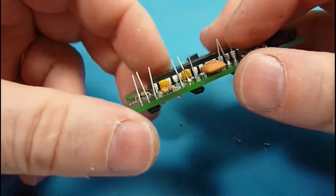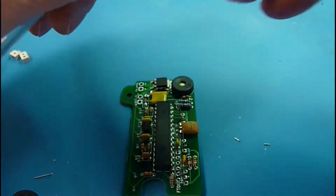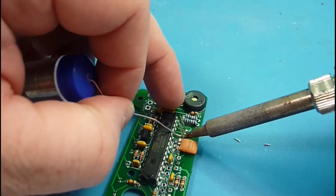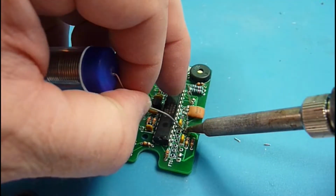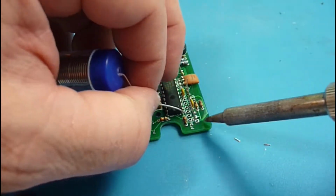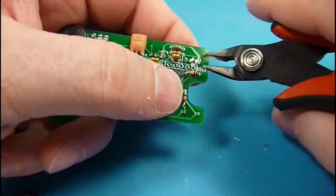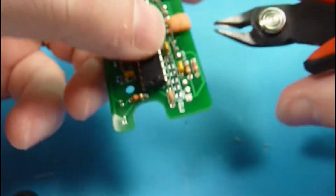So the omnipolar means that we don't have to concern ourselves with the orientation of the magnet on the clip. It just has to be a north or a south magnetic field, and that kind of makes life easier. On those Geek Spinner kits, I actually ended up gluing the magnets to the caps ahead of time because it was so error prone. Even I had trouble getting them in the right orientation 100% of the time. So I want to remove that hurdle for somebody doing the kit.